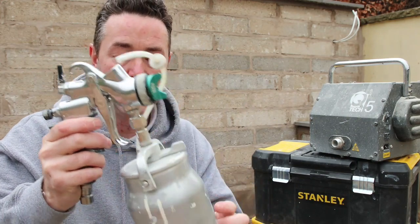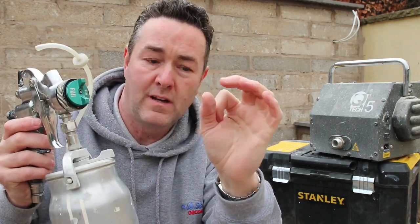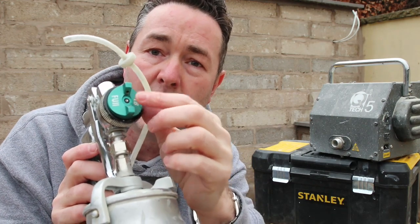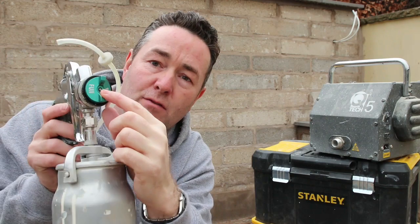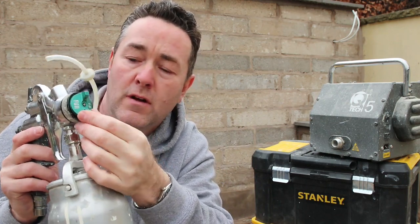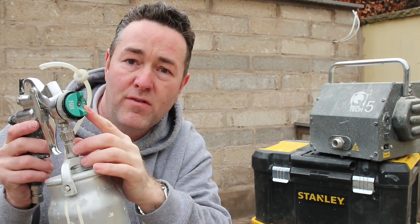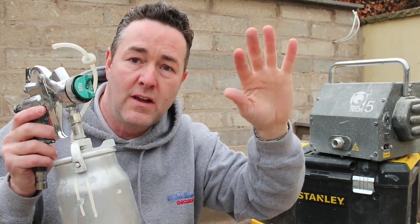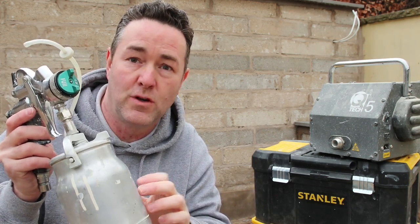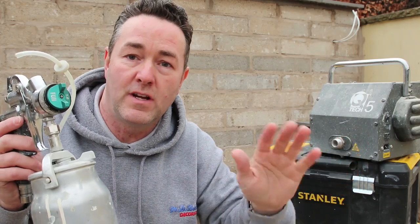Your paint is in there, it goes up through there and out the front. The paint comes out the front like little ball droplets. The air atomises through the holes in the air cap - we used to call them ram horns at college. The air comes out there, mixes with the paint, spirals it across, and hits your surface. If your paint is too thick, it will droplet onto your surface and give you a bit of texture - you don't want that. Get your paint viscosity right so it mixes with the air and gives you a lovely finish when it's dried.